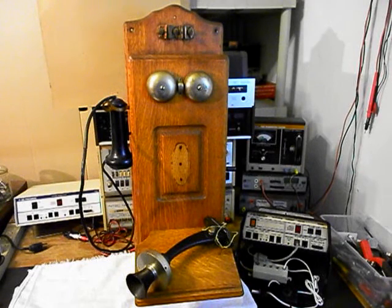Now we're also going to upgrade the transmitter. We need to work on the solenoids and the bells. The bells are touching the door right now and they are not supposed to be. So we have to look at that situation and go through and troubleshoot and make our repairs.